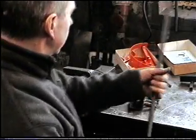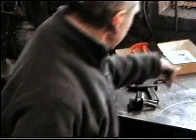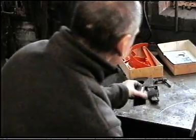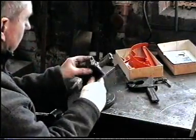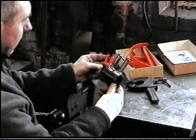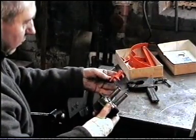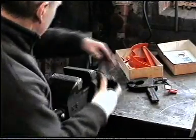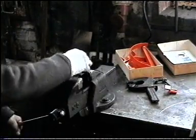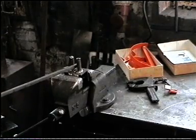Now, to bend this bar to make this jig, draw a circle on your bench, perfect circle. You have to make yourself one of these. That might look familiar. It's the same as the cranking jig, only bigger. Just a bit of angle, anything you can find really. 16mm solid bar, or square, or thicker. Exactly the same principle, and it's heavier material.